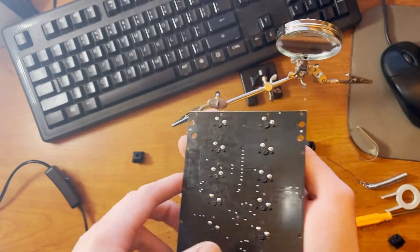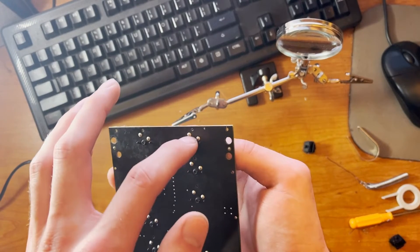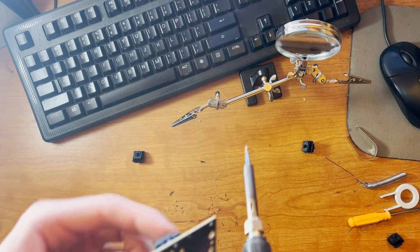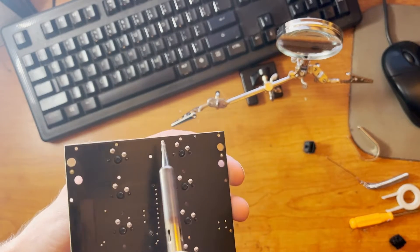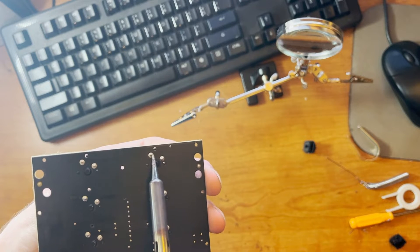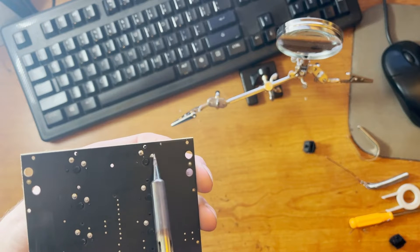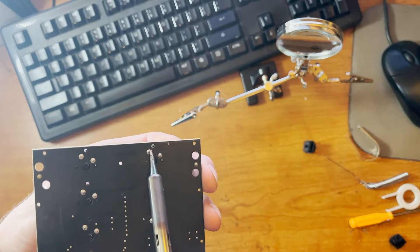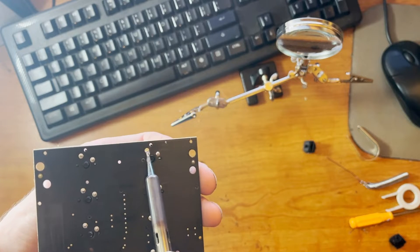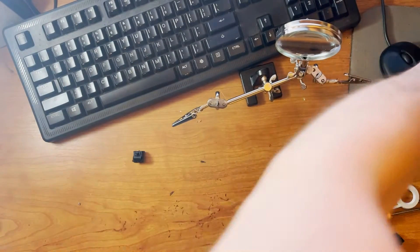I think my soldering iron's heated up enough. I'm looking into the phone to make sure I'm getting everything into the shot. We're going to be taking these top two keys off. You have to unsolder these both at the same time. I kind of grip the key cap with one hand, then I'll take the soldering iron and go back and forth between the two soldering points. Because you have to do them both in order for the key to actually come out, but you only have one end on the soldering iron. So you've got to kind of go back and forth, heating both of them up, pulling it out little by little. Your fingers are on the other side gripping it and pulling on it while you touch it with the soldering iron. Just like that, I was able to pull it off. This key is absolute garbage, so I'm going to set it off to the side. That's one.